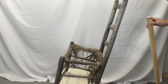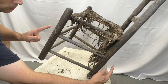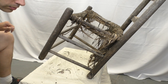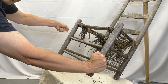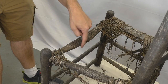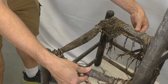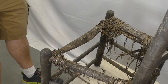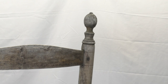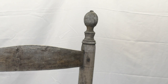A low chair like this was meant for casual sitting where the user would lean back, putting all kinds of stress on components. With the chair leaning back, the side rungs would mostly be under compression — and any wood is strong in compression, so silver maple is a good choice. But the front and back rungs would be subject to a lot of twisting, so oak is the timber of choice, especially in the back where only two rungs hold the whole thing together. Up at the seat, all rungs are oak and carved into a wing shape; as the user sits on the flexible rush seat, the rungs are pulled inward and that shape makes them much thicker in cross-section, allowing them to resist that pulling force. The maker understood all the forces at work, so the top back slat is pegged through the ends with split square pegs, probably made of oak — the other slats aren't pegged because as long as the top one holds, everything else will be fine.